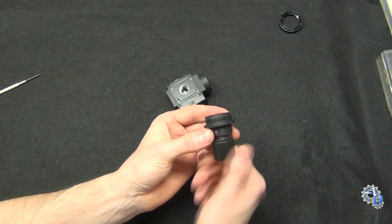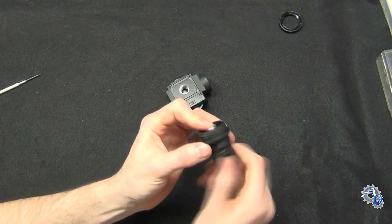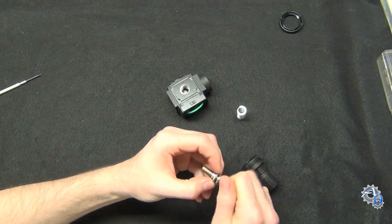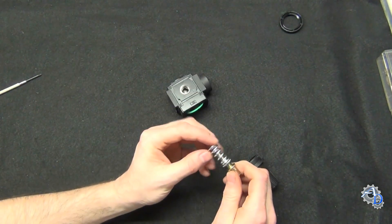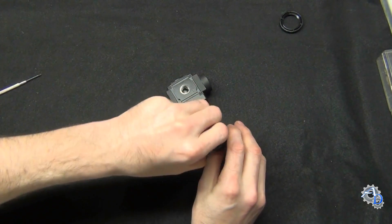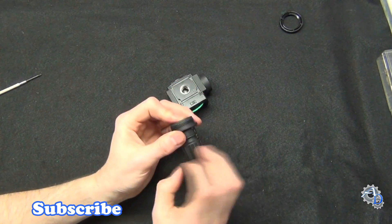This thing works like a tube of chapstick. There's a pressure regulating spring in there — see how it comes up when you increase the air pressure, and the opposite when you turn it back down. What you have here is this outer part turns while a nut stays in place inside, and the nut moves up and pushes that spring out. Those protrusions in here hold the hex nut captive so it can't turn — it forces it to move up or down.